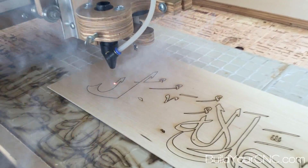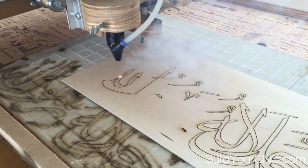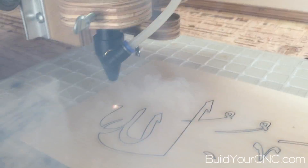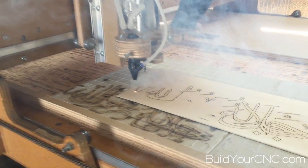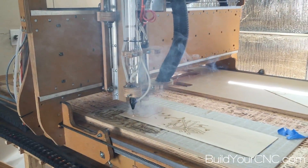However, we elected not to use the compressor because we are going to try using blue tape to see if that minimizes any markings. The air assist blows the smoke throughout the room quite dramatically. The feed rate during this process was 90 inches per minute and we were close to the maximum intensity.